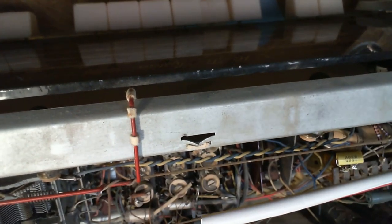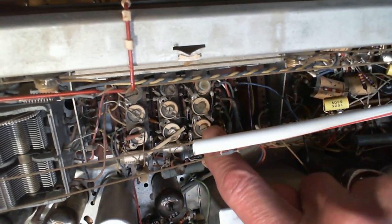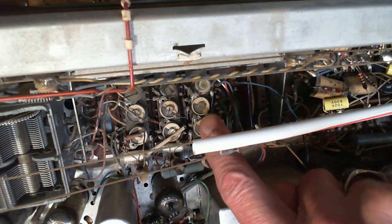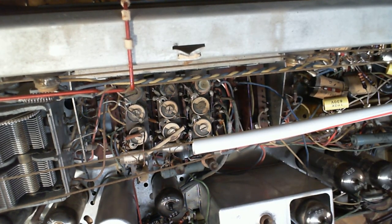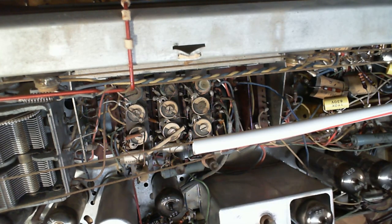Now that's a little odd because that row is full of tuning controls for tuning stuff. Yet according to the switch diagram, this is nothing but switching the audio around. It shouldn't have any of those coils there. Normally these coils sit on top of the switch that pertains to them, but not necessarily. But that's a little unnerving now.